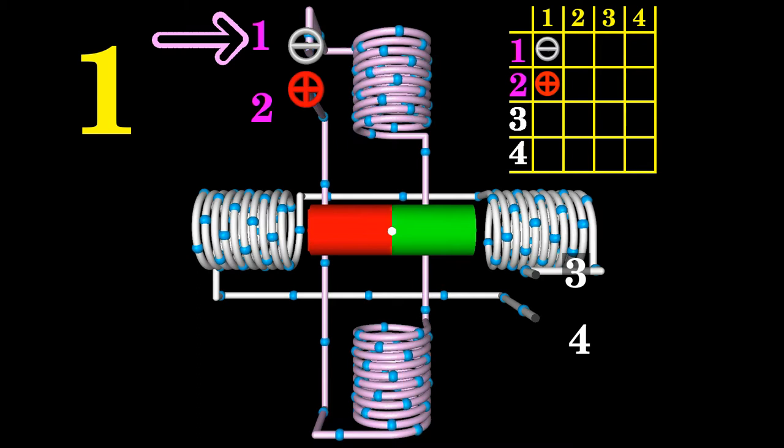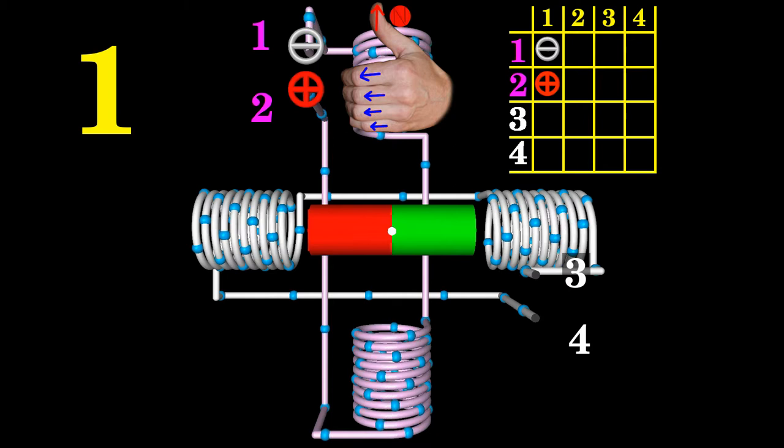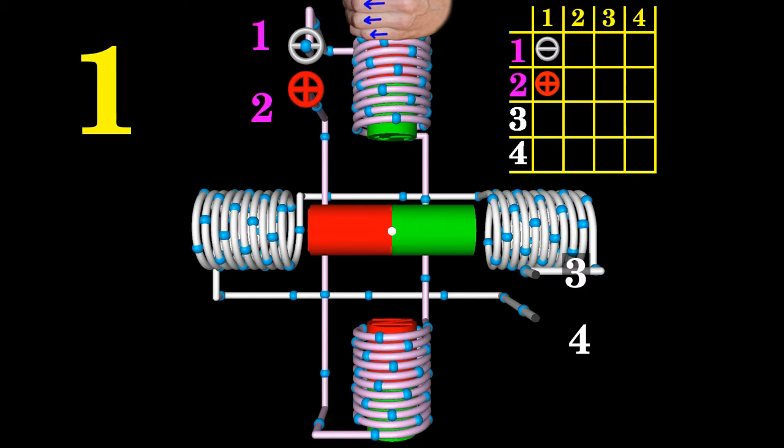Note that the upper end of the wire, which is terminal number one of the motor, is connected to the cathode of the voltage source, while the lower end, which is terminal number two, is connected to the anode. If you wrap your left hand around the wire of the solenoid with your fingers in the direction of electron movement, your thumb points towards the magnetic north pole created by the electromagnet. As you can see, the north pole points to the top of your screen.